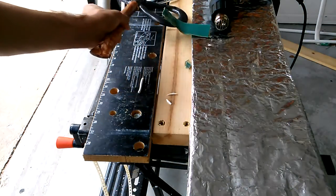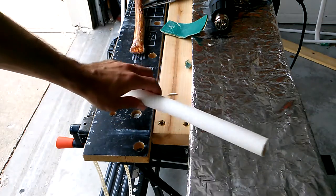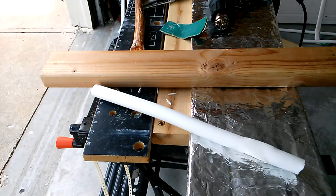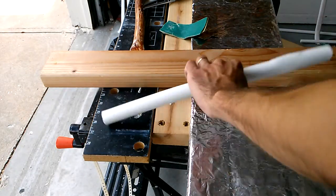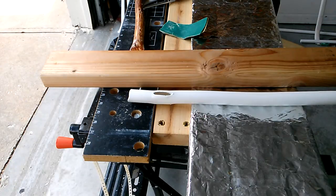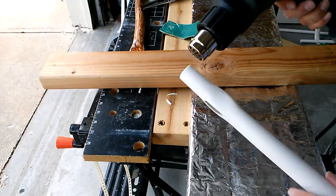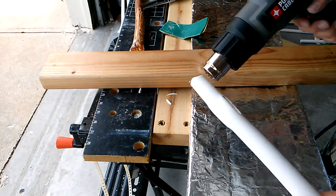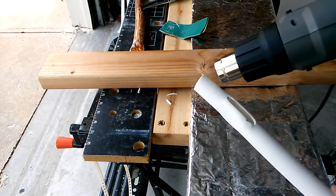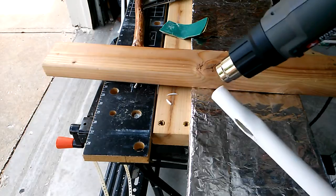Welcome back. Now two minor details to attend to: first, closing off and shaping the tip and shaping the bottom. We're going to go about that by heating both ends and then flattening them. If you have a hand clamp, that can be used to great effect and speeds things up. I've already gone and sanded it — so this is all ready for the next step, which is finishing. Now all we're doing is heating the end and not anything else. Angle it away so you're less likely to have air splash back down the hafting and heat other areas.